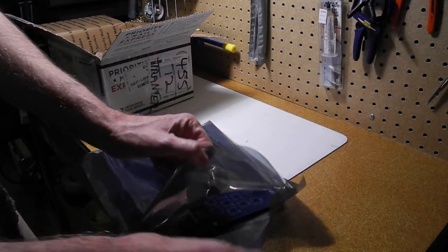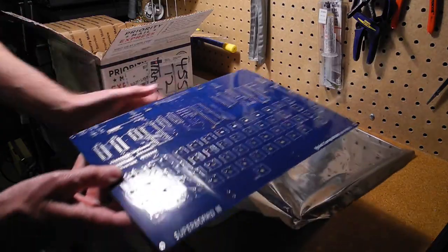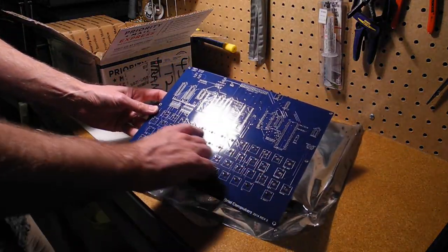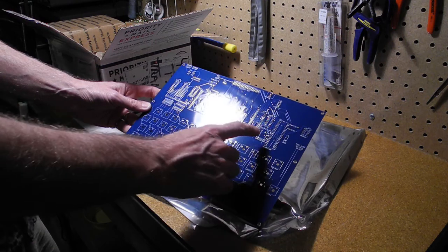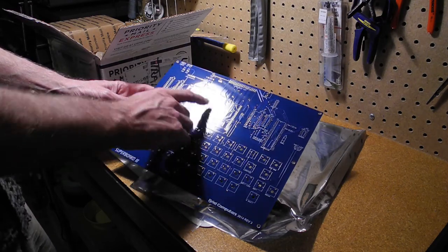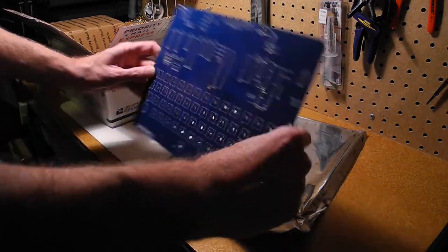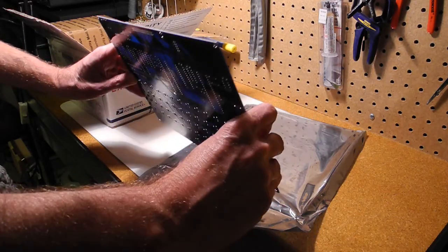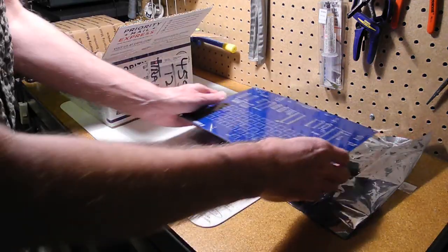It had, as well as all the circuitry, the keyboard on it. This is not as big as the original, but still quite large. As you can see here, I can see the location for all the keys as well as the chips — the 6502 processor, the Propeller CPU, serial interface, static RAM, some individual logic chips, video output, power, and so on. It looks like quite a nice silkscreen solder mask board, with an interesting blue solder mask. That's probably the most important part of the kit.